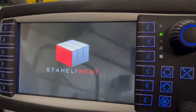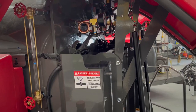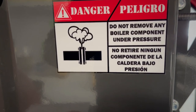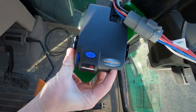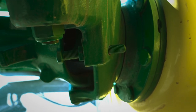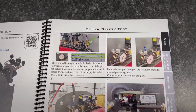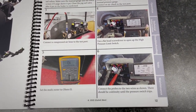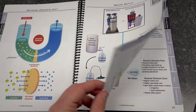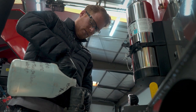The 331 is very safe. If an emergency arises and you need to shut off the machine quickly, you can touch the power icon on the touch screen or turn off the tractor. For your own safety, never remove any component on the boiler while it is still under pressure. Make sure the brakes on the steamer are working properly and always make sure your tractor steering stops are set to prevent oversteering. Once a year you should perform a boiler safety test to ensure all safety components are functioning properly. To ensure a healthy boiler, only use soft water or reverse osmosis treated water in the boiler, and add half a gallon of boiler guard chemical each time you fill up your water tanks.